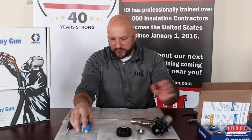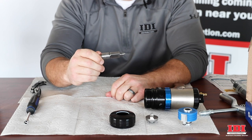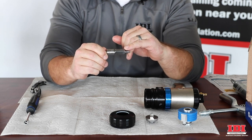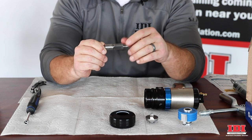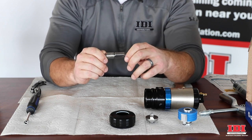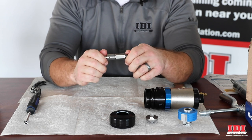You're not going to change anything the way you currently do business on a job site. The idea is that you can take it off, put a new one on, and keep spraying. Another feature of the new gun is the new mix chamber design. Beyond the three-piece design, this mix chamber is Chromex coated — something Graco has been using for years, now applied to the mix chambers. With the new hardened Chromex coating, as well as the polycarb alloy side seals the new cartridges use, the goal is that instead of replacing six to ten mix chambers a year, maybe we're only replacing them once or twice.